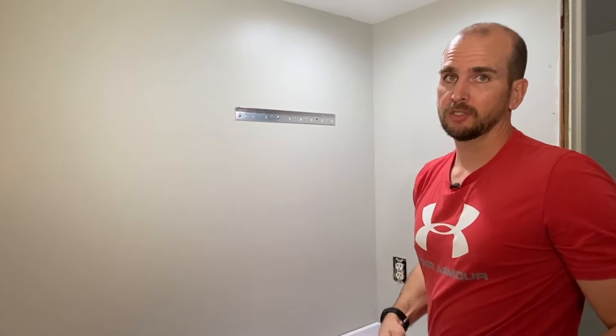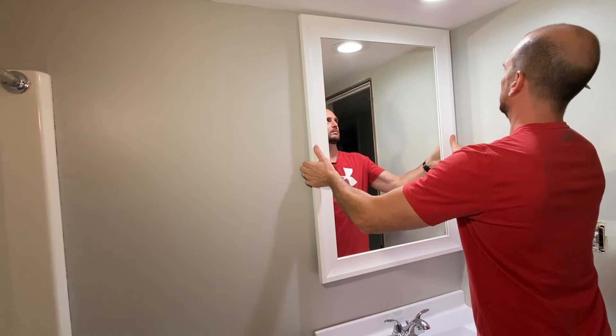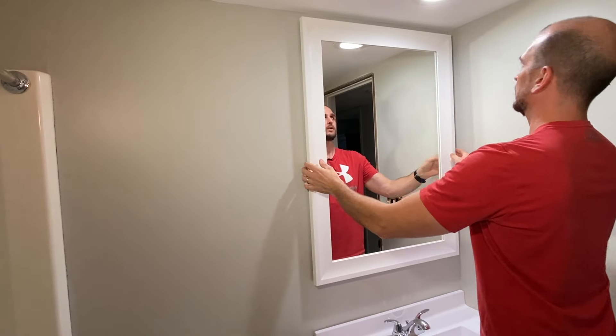Your combination will be a little different depending on where your mirror is going and where the studs are in your wall. Once the bracket is in place you do have additional side-to-side movement — about an inch and a half — so you can fine-tune alignment. That finishes up the install. The mounting bracket is going to be the toughest part. If you're having trouble with the drywall anchors, I'll put the exact dimensions and a link to toggle bolts in the description that will fit this mounting bracket for a more secure hold. Don't forget to subscribe for weekly home repair and improvement videos — take care.